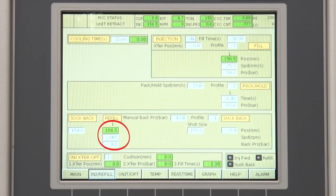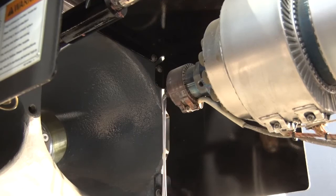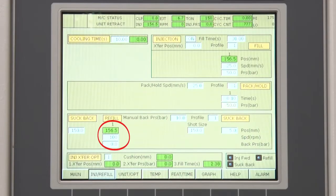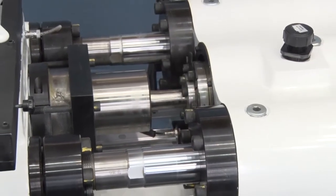Initial screw speed should not exceed 15 to 20 rpm so as not to damage the screw or barrel. During this time, when the screw is recharging, no one should be standing near nozzle. As the screws start to refill, the motor load will gradually increase. This is an indication that material is feeding. Once a steady flow of polymer exits from the nozzle, the screw speed can be increased to the desired operating RPM. Machine is ready for operation.